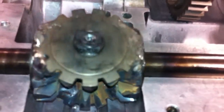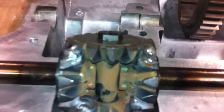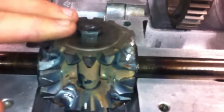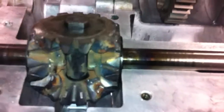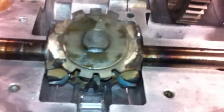I didn't weld the pin in yet, and it does move just a little bit. My idea now is I'm going to knock the pin that way, take it over to the belt sander and take a little bit off there, knock the pin the other way, take a little off there, push the pin back, make sure it floats nice in there, turn it, make sure it spins alright, and weld the pin in. I'm going to probably weld the axles to it too.